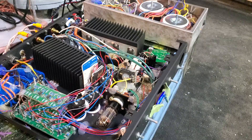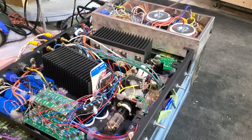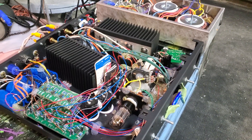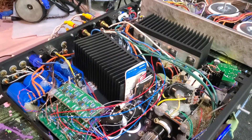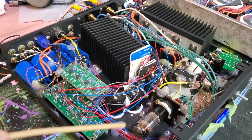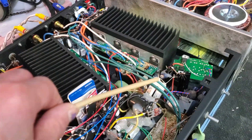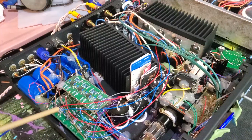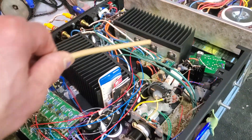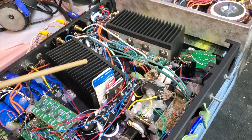The main reason for doing a conversion project like this is to save costs. You don't want to buy a brand new amp, so we're saving the chassis, saving part of the front end — in this case the tube, the original gain stage, volume control, control circuitry, filament supply, and part of the output stage power supply. I took out the original class D amps in this middle section to make room for this class AB output stage.